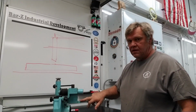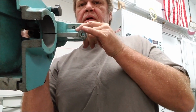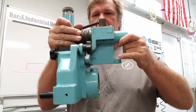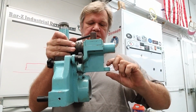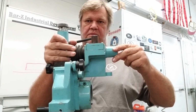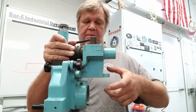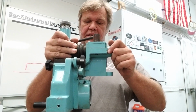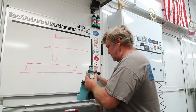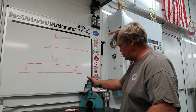and I'll point you back out to that jacking bolt in the back. This eyelet right here, this eyelet, and you just put 2 nuts and a fine threaded bolt down to the spindle, and that just ever so slightly tips this unit, and it's going to help keep it in alignment too because it's always there. It's going to tip that diamond in the axis of this rack and pinion until it matches the axis of your machine.